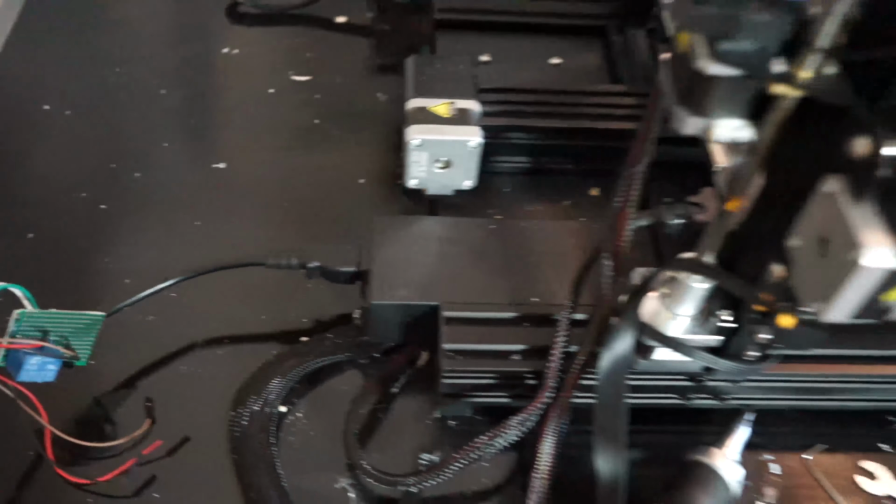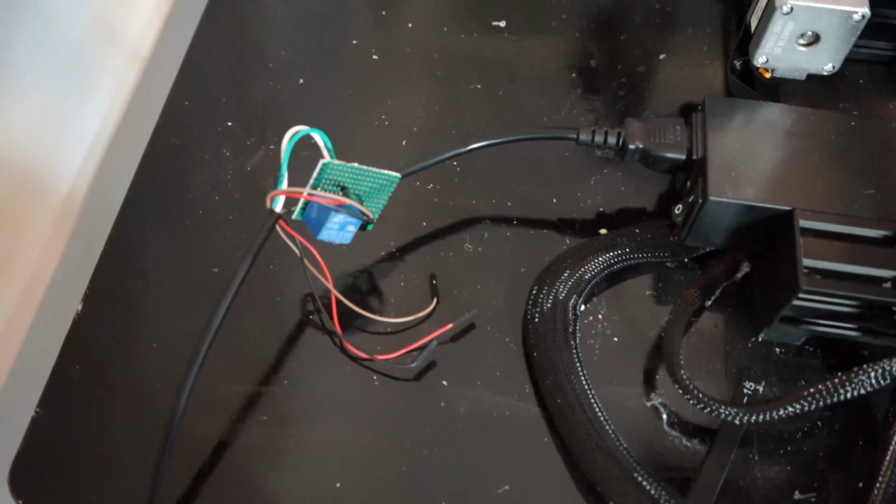So there we have it. We're gonna plug in ground, 5 volts, and 3.3 volts into the Raspberry Pi. So make sure you know which version of Raspberry Pi you have. Look at the pinout because that matters. Always make sure to plug in everything before you plug it into the wall. Do that thing last. I made a case for you guys.